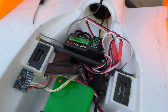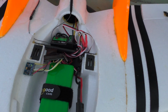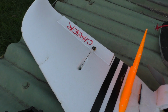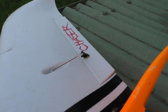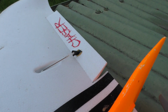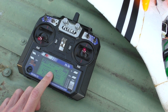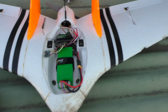And I had to fiddle around quite a bit getting the elevon mixing correct with the new servos, and getting everything to match up correctly, but I'm pretty sure I have it working now. I had to hard code some rate reduction for the pass-through mode because it was just obscenely high travel, and now this is a 30% reduction and it's still quite high, but this is about what I had with my normal elevon mixing with the normal receiver settings before. By the way, you have to remove the elevon mixing from this when you're flying this. You just give it normal pitch and roll instructions for each channel.